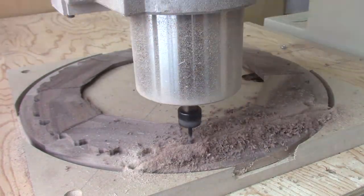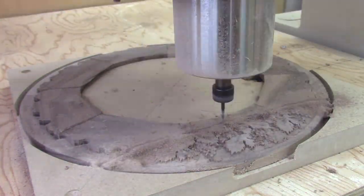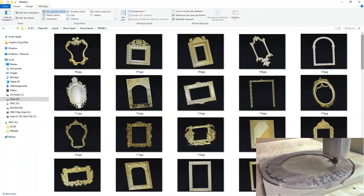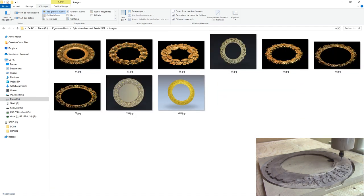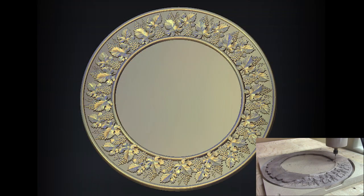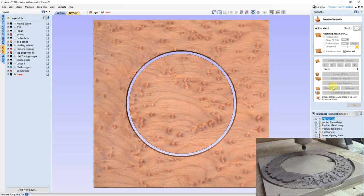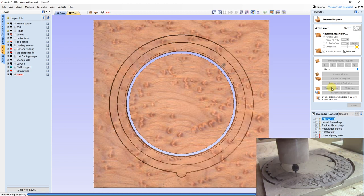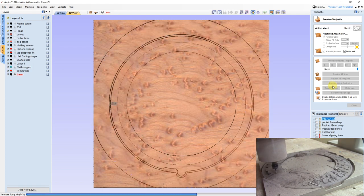I have a little bit of time to talk about how I made this design — as a matter of fact, I have 32 hours and 20 minutes. Last year I bought a bunch of fancy picture frame STL files; there are hundreds of them. In the end, only a few were to my liking and I ended up choosing one for René's frame. I started with Aspire to draw the shape — it's the shape I burned on the plywood, which is the shape of the eight pieces glued together. Then I designed the back of the frame. With the program I was able to see what it would look like and I was very satisfied. Using all those lines again, I was able to make the mold to hold the frame to the CNC table.